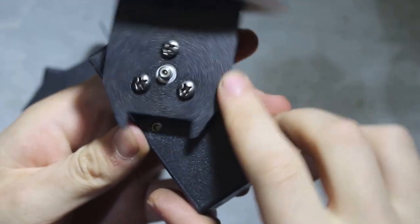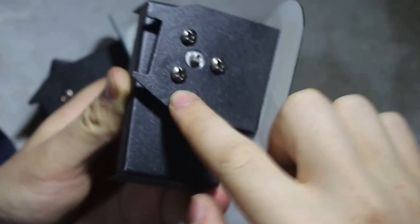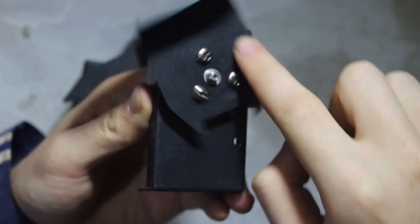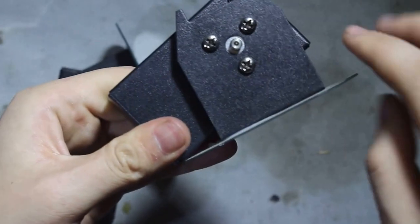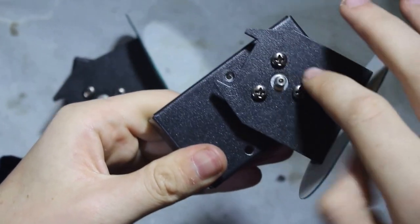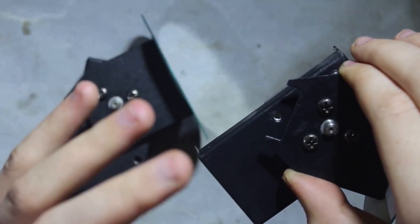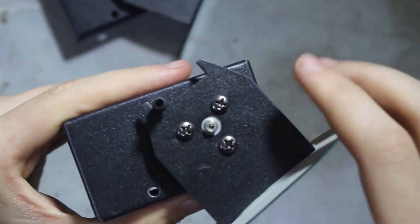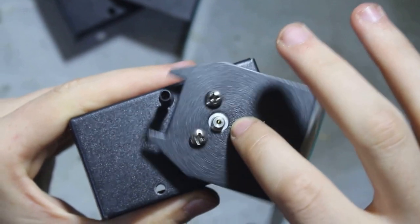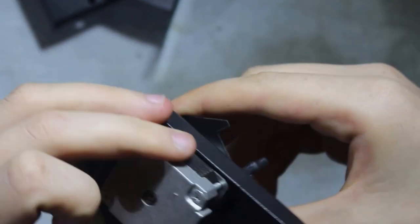I can show you here. As you can see, the screw needs to go in there, and because it's not there, this mirror has a movement of, well, let's say the end stop is a physical mirror until it hits the bracket on both sides. Now that's not a good thing, because the mirror can get damaged, and then it's like when one bulb is dead in a row of 8 bulbs. It just looks bad. So just going to put in a new screw, and I'm trying to figure out what this is. The motor that's making a lot of noise. I just can't figure out why this thing is making so much noise. It should not. But then again, these motors aren't that expensive to replace.